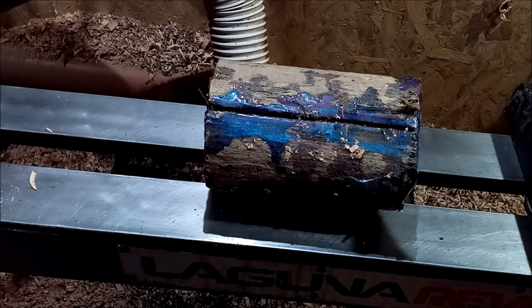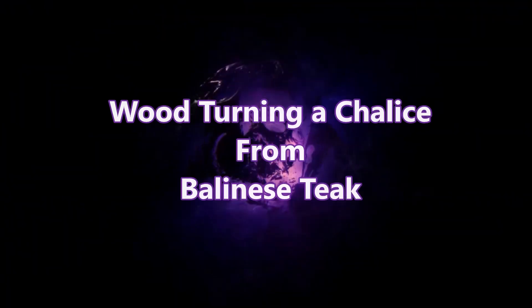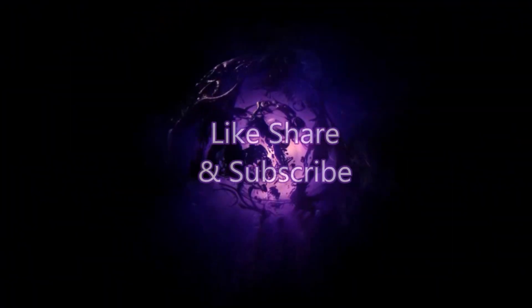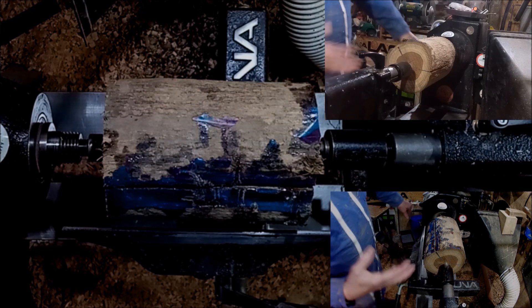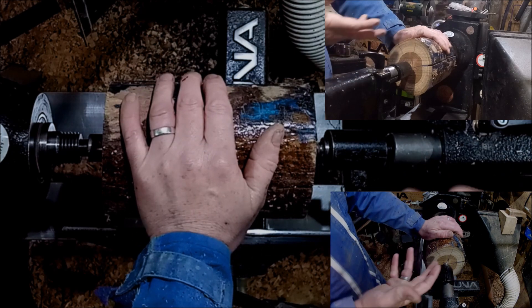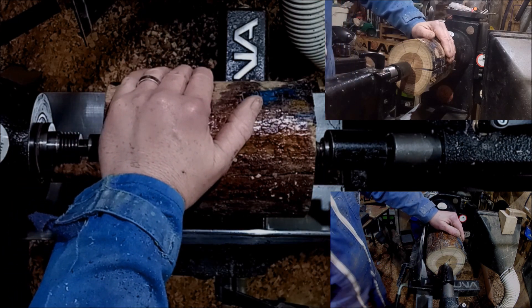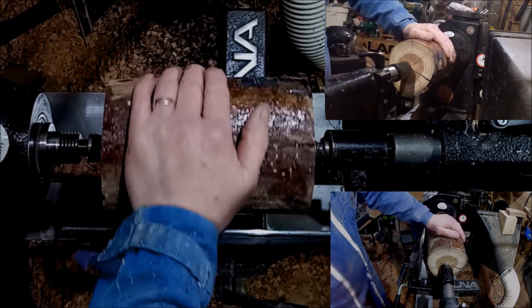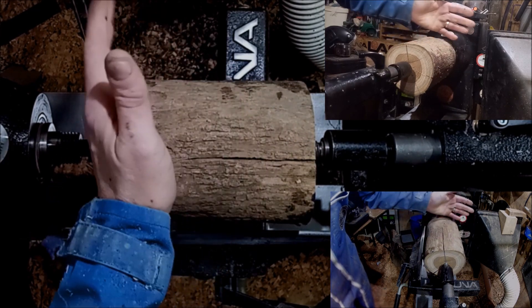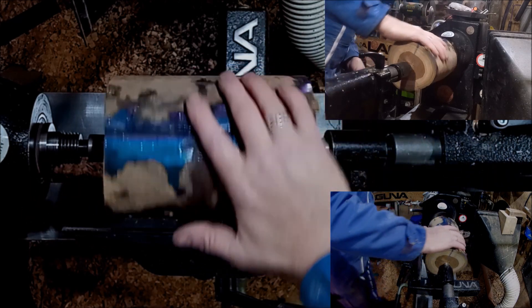I've been dumping bits of resin into this for months. In the lathe I have a piece of that natural teak — the Balinese teak. When I got it, it had loads of cracks in it. So what I've done is, every time I've had a spare bit of resin left over from something, I've been throwing it into these cracks. I don't think I've got them all, so I'll have to use some CA and sawdust to fill whatever I missed. But I'm going to turn it into a chalice. It's a little bit different because of all this resin in it, and I think it's going to look really nice in the middle of the stem, because it'll be going down into the hardwood.